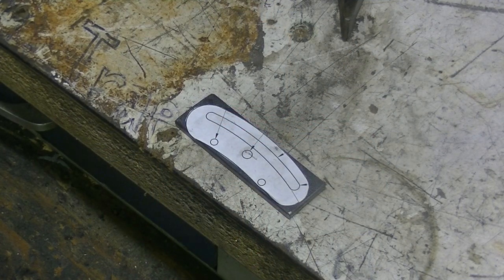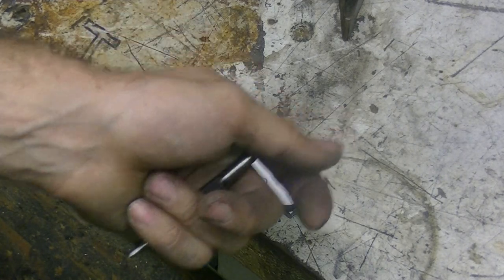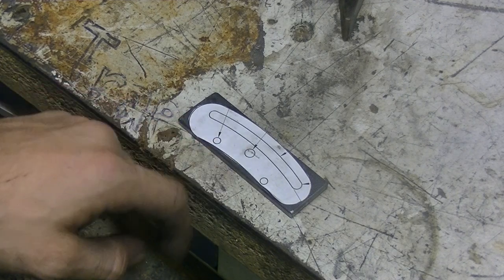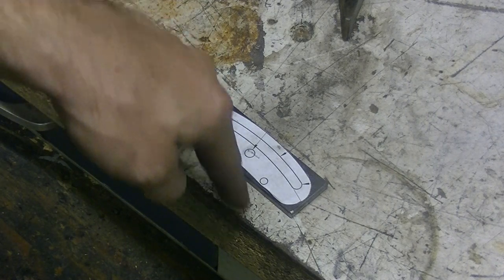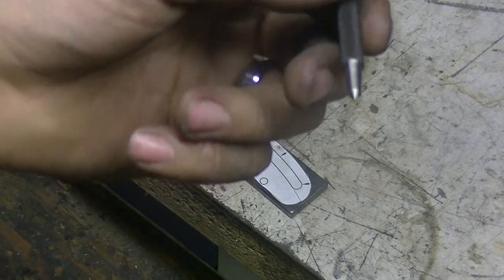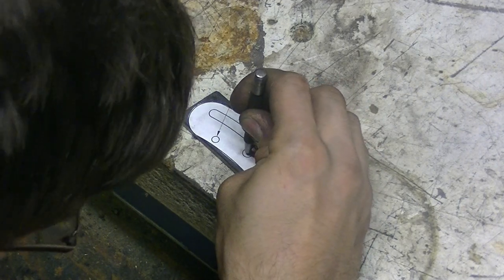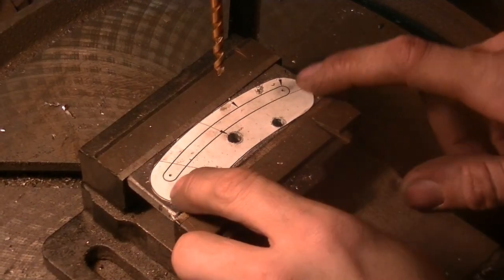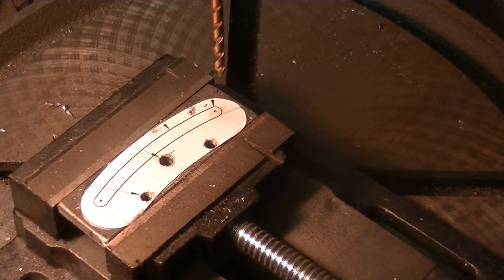Okay, we're back. Kind of a square one — what happened was my center drill tip, a really tiny center drill, broke off. I thought it fell out of the hole but it didn't, so when the drill bit tried to drill through it was deflected to the side and drilled the hole next to it. So I'm starting over and this time I'm just going to center punch the hole — I think that'll be more accurate anyway.